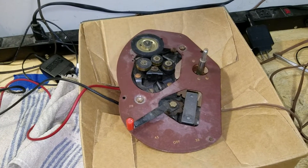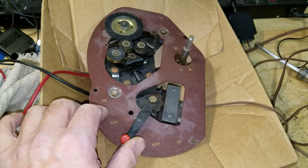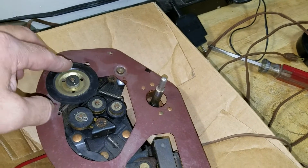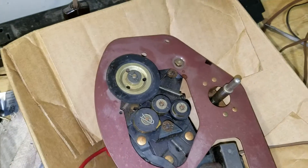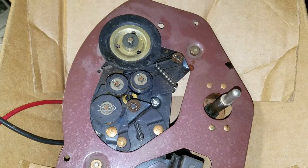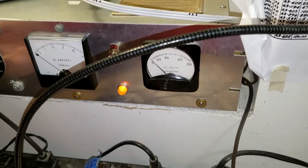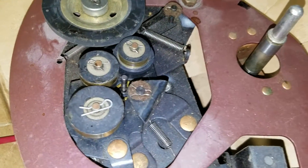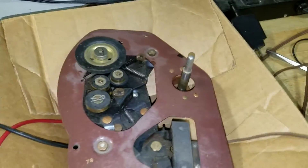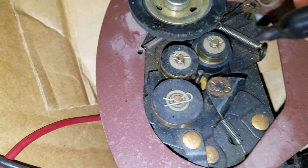I've got 120 volts connected to this motor. There is no switch because it's connected directly to the motor leads, but the speed control still works. I don't expect it to turn because this normally rides up against the platter and puts pressure on the turret mechanism — what I want to find out is whether the motor will turn. Now we can see the motor spindle. I'm going to put some juice to it — Variac is hot. It's much easier to see if the motor is spinning if I put a little mark on top of the spindle, so let's do that.